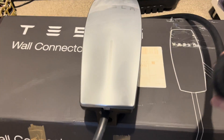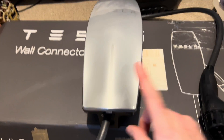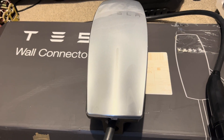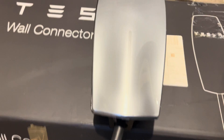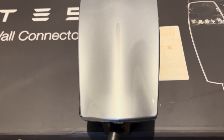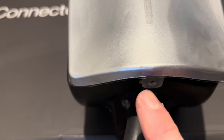It's this switch or the temperature sensor in this connector that normally fails. Not a lot of people know this, but you can open this charger up and put it into legacy mode where it will no longer require the temperature sensor or the switch, and it should start working again. So we need to open it up.